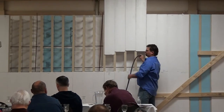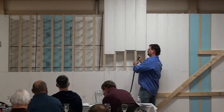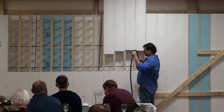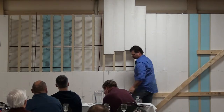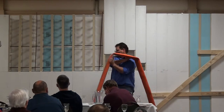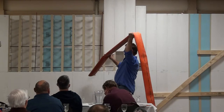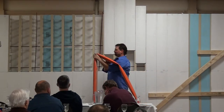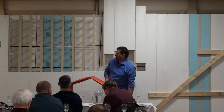When we're pouring taller walls — real tall walls — and we stack our panels, you've seen it now several times, but we can lift up the panel and stick the pump hose right to the side of the wall to pour the concrete. It's nice because you're just vibrating small lifts. You're not trying to get a really long vibrator from the top of the wall where you don't know where it's going — it could be going four feet in the wrong direction.